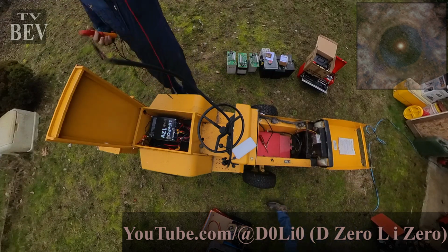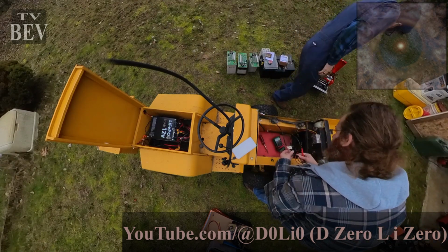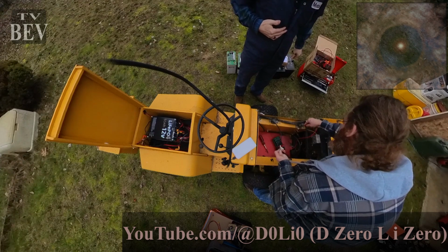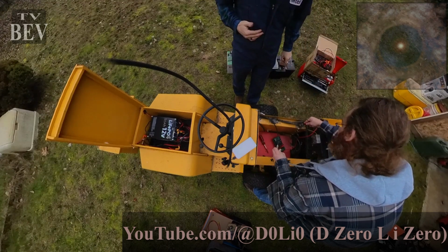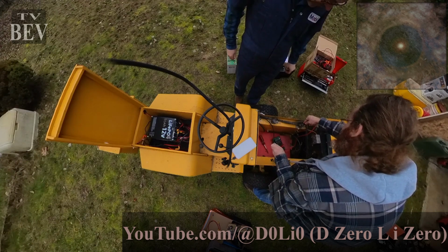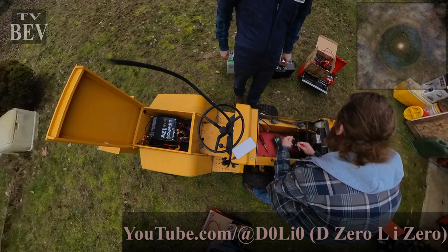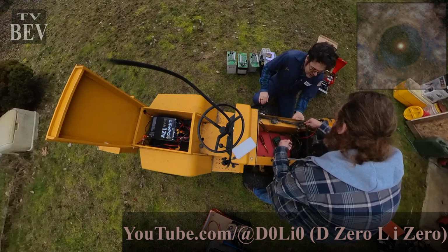So is this hot? It'll be at pack negative. Okay. And I kind of had to probe the cable to get it to light up. I went in underneath to get the positive. There's so much corrosion on top of that screw. There we go. Yep, just really bad connection. We're still powered up? Yep. I could go up inside the terminal from below.